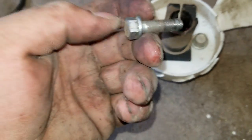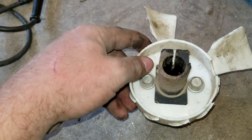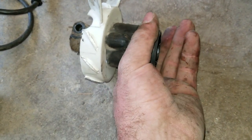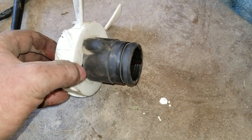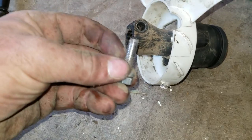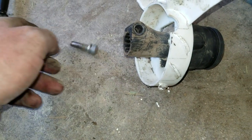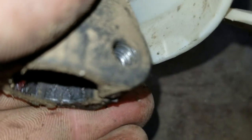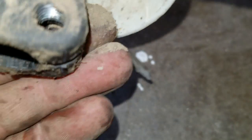When I removed this bolt from that little hole I cut, I noticed how stripped out it was. It came to me that the reason why is because I had taken this in for warranty work — for that rubber bellow that sits right here, just that collar that protects it. That was torn and whipping around down there, so I tore the rest of it off and brought it in for service when they serviced the quick attach for the front end loader on the hydraulics. They must have just ran that thing down and stripped it — that's why it came out like that. Luckily though, those threads still look good. I'll chase it with a tap. They're not stripped on that side, so luckily the bolt was softer than the metal they made that out of.